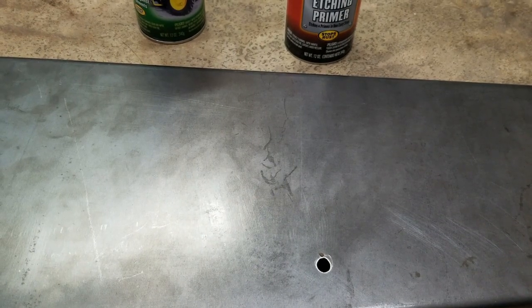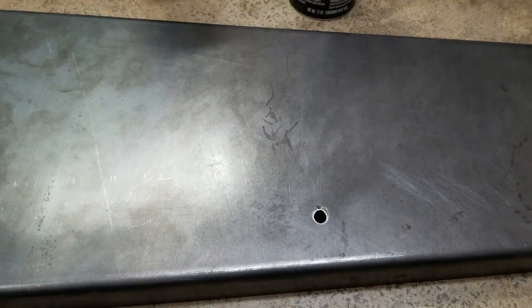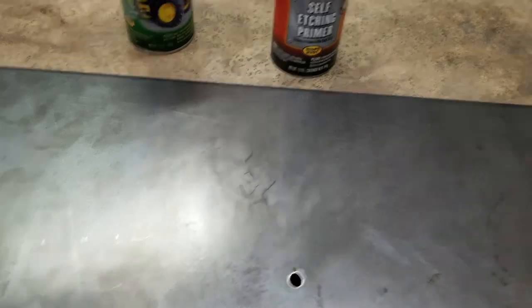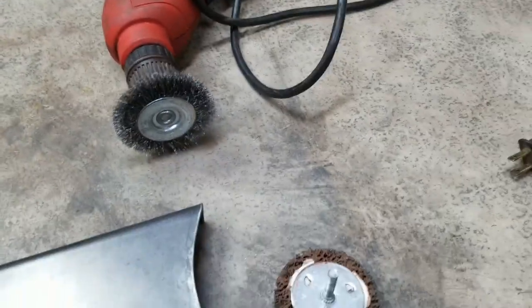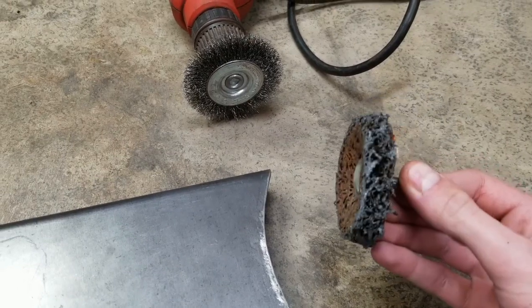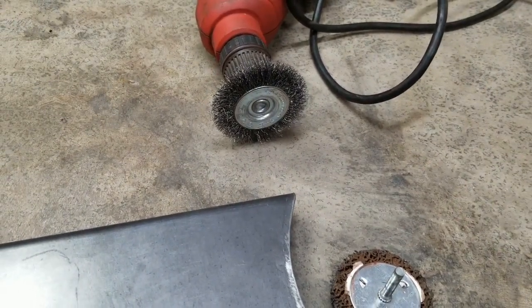You don't have to get it down to bare metal, but it makes the paint stick a whole lot better. How I basically take it down as close to bare metal as I can get is by wire wheeling it with a wire wheel on a drill, or by using one of these abrasive wheels on the drill. This pretty much takes off paint, rust, and really anything — it gets it down to bare metal.